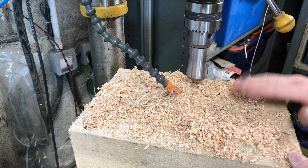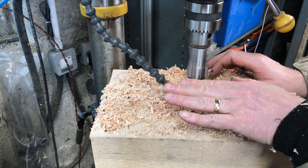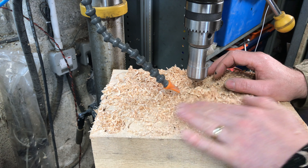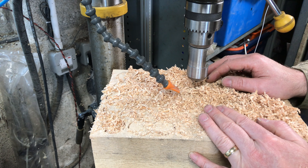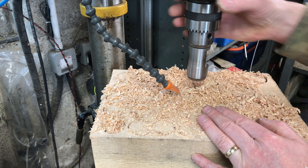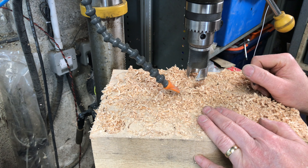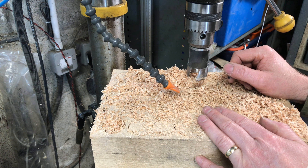There you go — that took a while. Managed to get 36 out of that. While I was cutting it I've been having a bit of a think: I've got a table saw, so what I'll do is put this up on the side on the table saw, cut 30mm down, and those dowels should drop out. I'm not going to get all the way in but I can probably get the first two rows, then slice it the other way to get to the others. So it's 36 — still need another four — but I'll do that with the other offcuts or turn this over and use the other side. This doweler is just starting to feel like it's losing the edge it had when I first started; the first hole was really clean and tidy, the others are still clean but a little more difficulty going through.